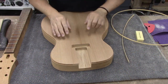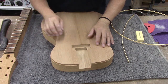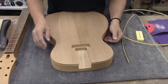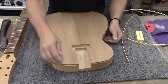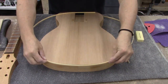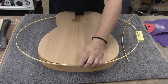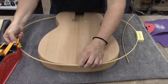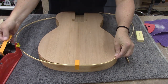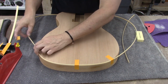Let's start with the body. This top is cedar and is super fragile and super thin, so one of the things I do when I route this edge — and I don't have footage of this, you just have to take my word for it — I did it in lots and lots of shallow passes. I wasn't trying to make the rabbet for the binding all in one pass. Start with a super clean, super new, super sharp rabbeting bit.